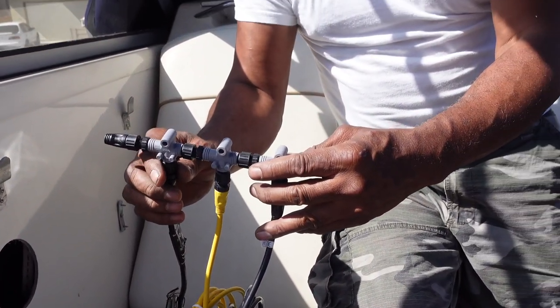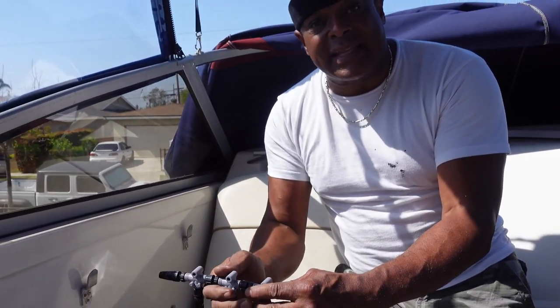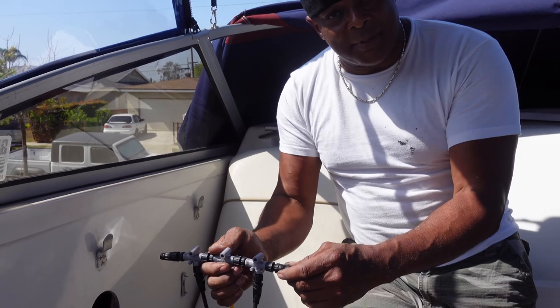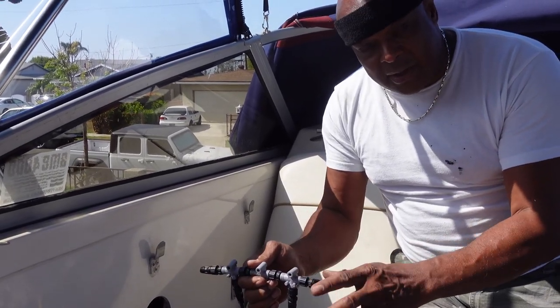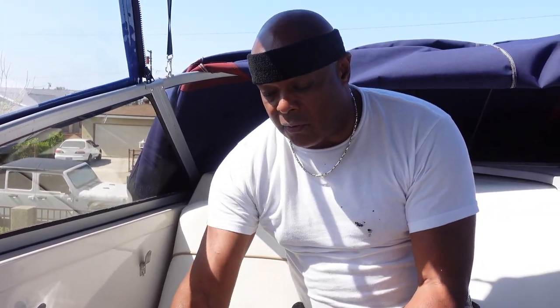And then I'm gonna buy another one called a GPS unit. Garmin has a little bitty ball GPS unit. I'm gonna connect that up to it. When I connect that, I'm gonna disconnect this terminator, connect the T-block on it, and reconnect the terminator and connect it up to the T-block. And it just keeps going on and on and on. So, that's it for now. On the NMEA 2000, like I said, it's the Garmin system, I like it. It allows all your data to be transferred between all items, so they're talking to each other. Of course, some items connect directly through the back of the Garmin, but you don't have so many connections back there. Like right now, I'm out.